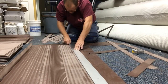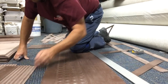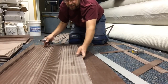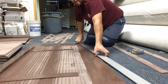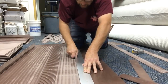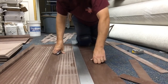As a matter of fact, if you're doing woodworking, that is the best way to get every cut the same, because if you try to measure out every single cut and get them all the exact same, like if you're building something, there's a really good chance that you're not going to. So I set up stop blocks, and that's pretty much where I got the idea for this. I just lay them down there, push my straight edge up against it, and move them, and my straight edge is ready to go. So it sure saves a lot of time on my measuring and cutting, and it gets it all exactly the same.